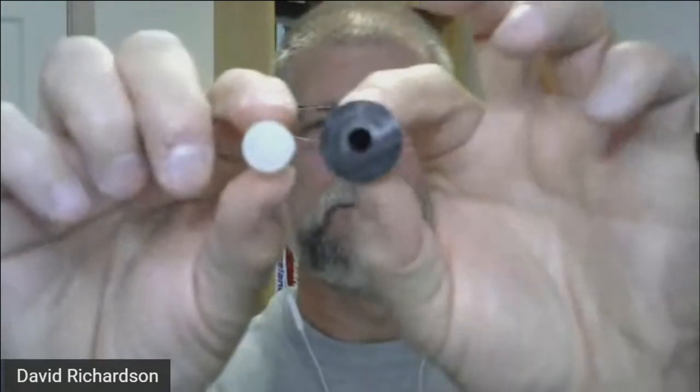A lot of guys will take little snap plugs and stick them in there. You've essentially turned a double wall connector into a single wall connector at that point. That's what I use, little metal plugs. This maintains the 1 inch clearance to combustibles and keeps that seal between both layers. Another one they make is high temperature silicone. If you want to hold both of those up again, I'm going to enlarge your picture here so people can see.